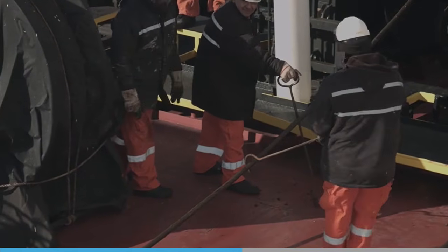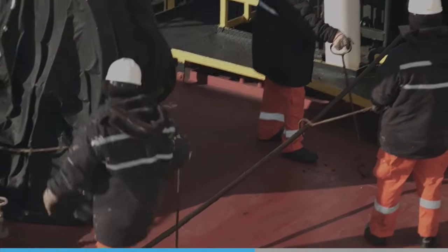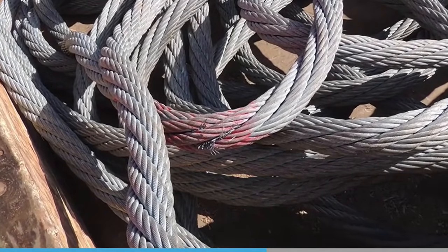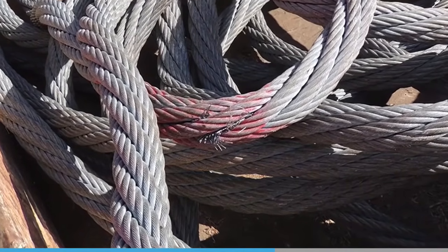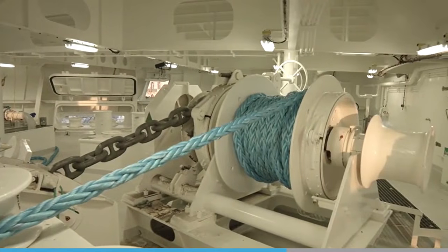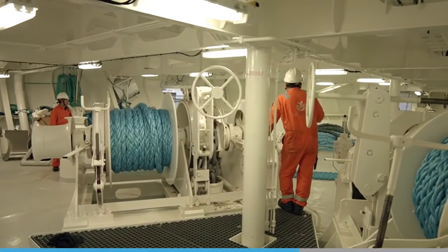It is recommended that gloves are worn for general handling of wire, but you should check your company policy to see if they should be worn when handling a wire during a mooring operation. It is possible that a wire snag can catch on a glove, trapping the hand and the person, and pulling them towards the vessel's side or an item of machinery. When working synthetic ropes, gloves increase the chance of having a hand trapped by a rope or in rotating machinery. Having close-fitting gloves and not getting close to rotating equipment minimizes the risk of trapping clothing.